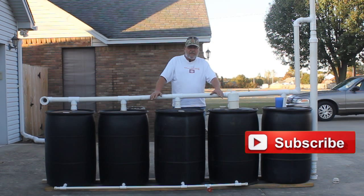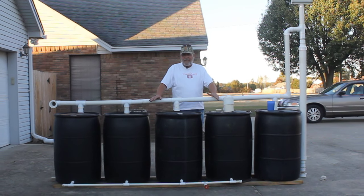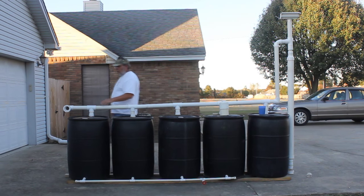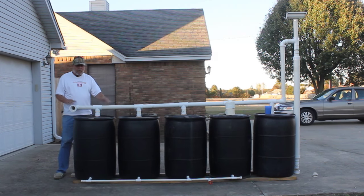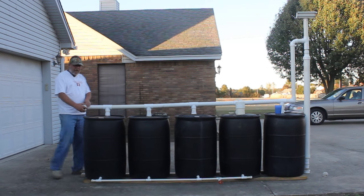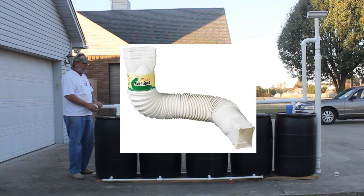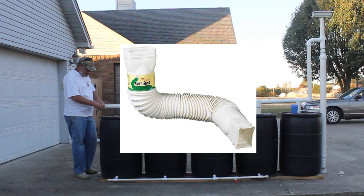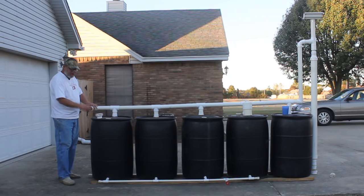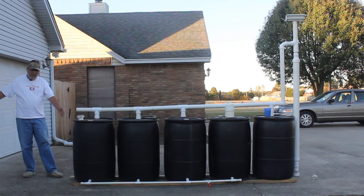This shop is 36 by 45, and it's only on one side with three downspouts, so I'm only getting one-third the water off one side — half the building. And in a one-inch rain, you would not believe these things will fill up. This is the overflow right here, because you've got to have an overflow — if this thing fills up real quick, where's the water going to go? I put this end on it for that. You see those flexible downspouts? They work great but don't last very long — the one I had lasted probably two years. It's kind of an accordion, so you can divert your water any way you want. You could also take this off and add more barrels to keep making it longer at a later date.